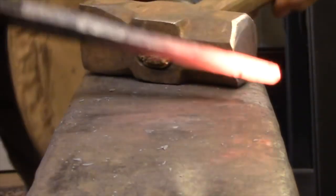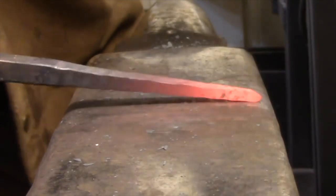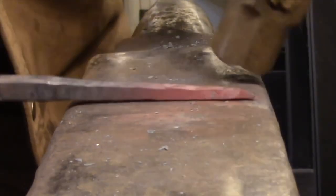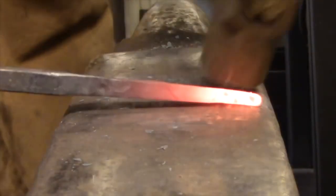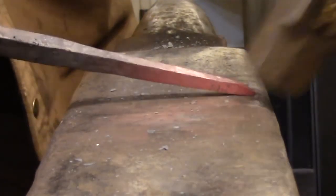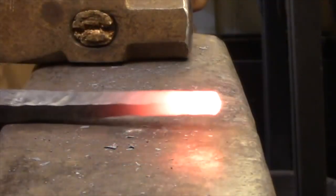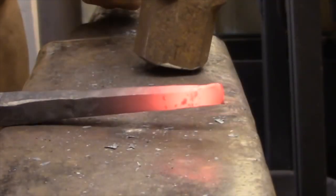The third technique isn't really a technique in itself but the ability to shift gears — to go from heavy hammering into something that requires very little effort. A lot of people have trouble putting a point on a bar because they haven't developed a sensitivity for how little pressure it takes to move such a small piece of metal. The key to forging a point on a bar is to first establish slopes on the four sides and then develop those slopes into a point. Hammering a chisel point is really just a matter of putting a slope on two faces of the bar and then turning the bar 90 degrees to control the width of that chisel point.